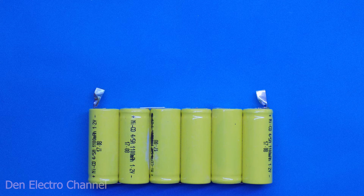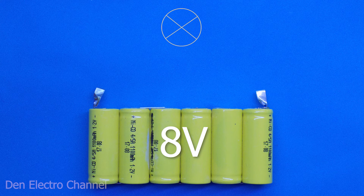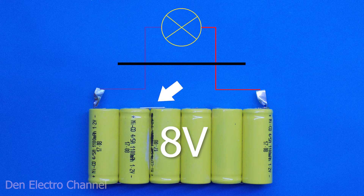The operating voltage plays a very important role when choosing a fuse for a device. The voltage of the entire battery where this fuse was located is 8 volts, and it doesn't matter where it is located — either between the batteries or at the output. As long as there is some kind of connected load, the voltage drop across the fuse is very small. But when a short circuit occurs, all the battery voltage will be applied to the fuse. The higher the voltage, the higher the current and the greater the generated thermal power — in this case, the fuse will simply bake and burn out.